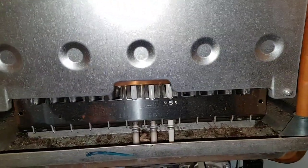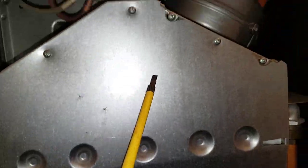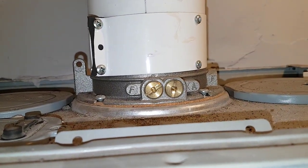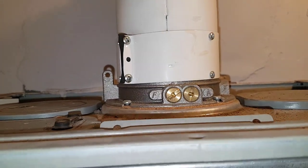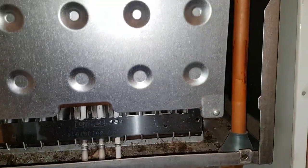It's just a standard efficiency boiler — the burner lights, hot gases go up, through the fan, out the flue and out. There are your sensing points for analysing and checking oxygen and flue integrity. That's the main parts of this boiler.